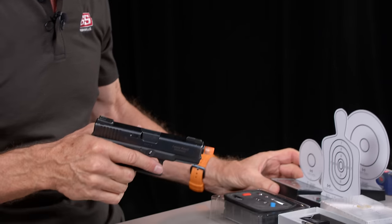I'll work with the striker — you don't have to take anything else apart. If you're new to this procedure, underneath the slide you'll see the striker lug, or firing pin lug. Underneath that, I'm going to pick it up a little bit. The firing pin is now in the back position — it's not breaching through the breech face. You'll notice close in here there's a little piece of black plastic — that is called a spacer sleeve. In order to take the slide cover plate off, I need to remove the pressure from the spacer sleeve.